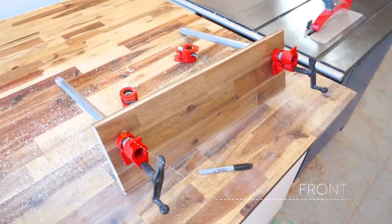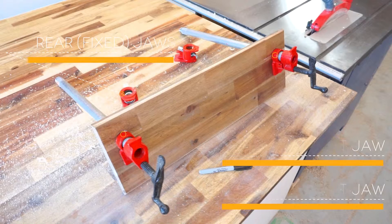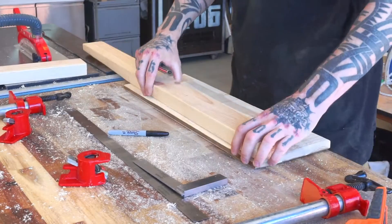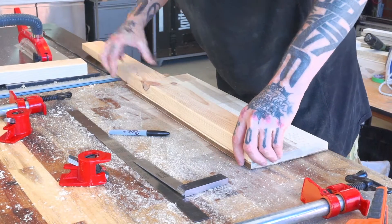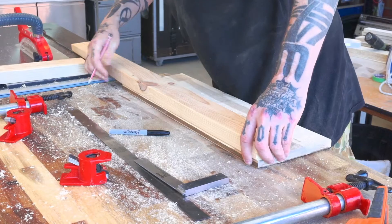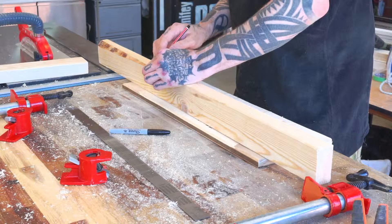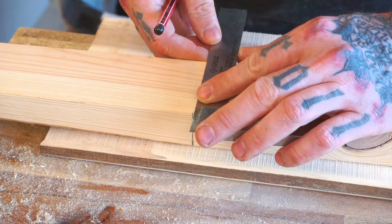Here's a clearer look at where we're at right now. Because there's an overhang on my bench, I need to make a spacer block for between the cabinet and the front face of the vice. I already know how long I want the face, and I've placed the mounting holes where I want them, so I can use these dimensions to determine the length of the spacer block.